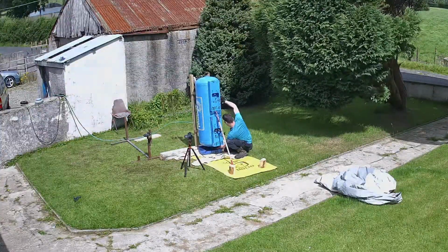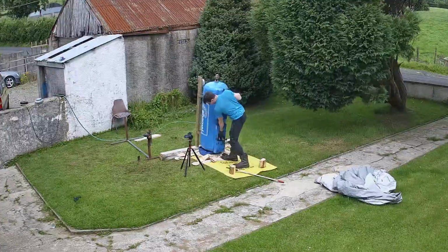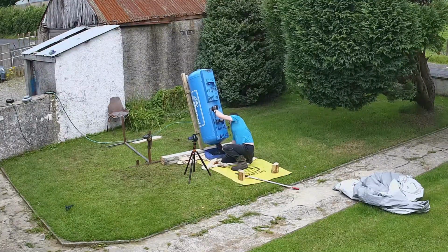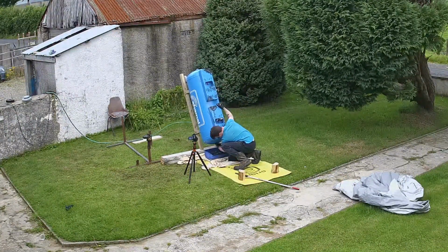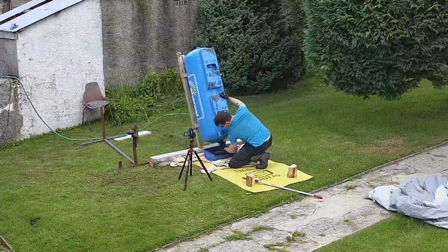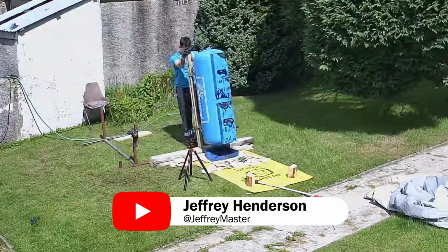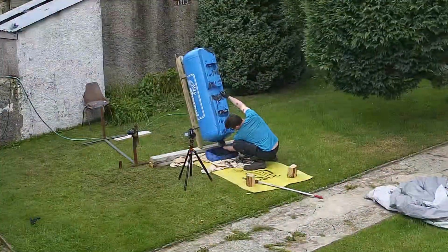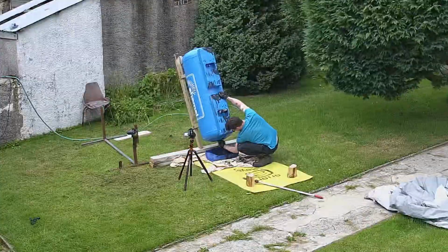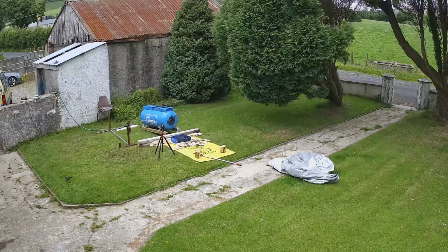So the media was removed by placing the vessel vertical, resting it on the laths of timber that were used for the rotational balancing technique, with the vessel held with the aluminium brush shaft now and again. I then proceed to poke, jiggle and pull the media down through the 2-inch port with my thumb and my index and my middle finger until all the media fell out. So I'm taking advantage of gravity here. So once the final screw was out and the glass shards were removed, I added kerosene to do a pre-rinse before a final rinse.